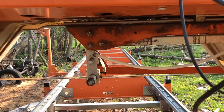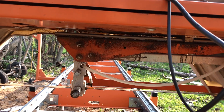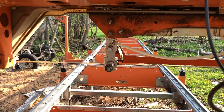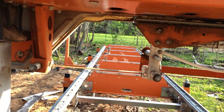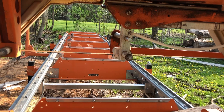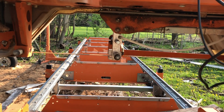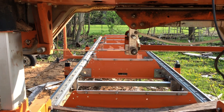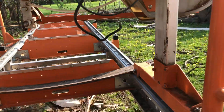For now I'll probably keep the blade guide manual. That's where varying the water flow comes in — when you're running a really narrow width you don't need as much coolant; at full width you need more. The controller will have logic built in to vary the amount of water based on cutting distance. Possibly also based on species — dry oak or hickory will need more water than pine — so there might be a species selection in the controller.